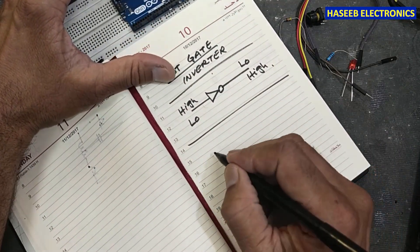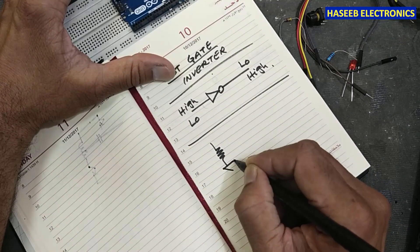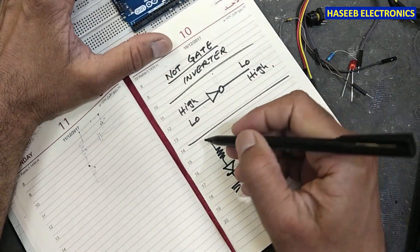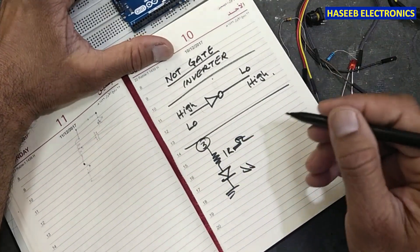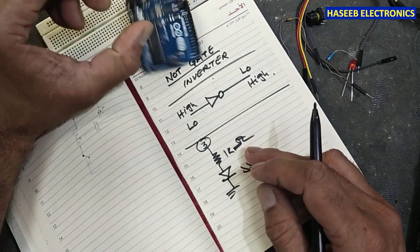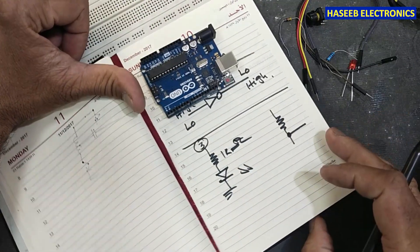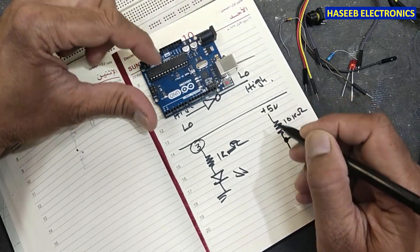We will use an LED to monitor the signal at a digital I/O pin. I will use a one kilohm resistor — you can use 330 ohm — at any one pin. For example I want to use pin number three as the output pin, and we will provide the input signal to pin number two. We will use a pull-up resistor with a 10 kilohm resistor and plus 5 volts from the Arduino power supply.